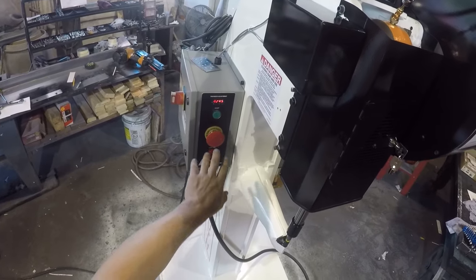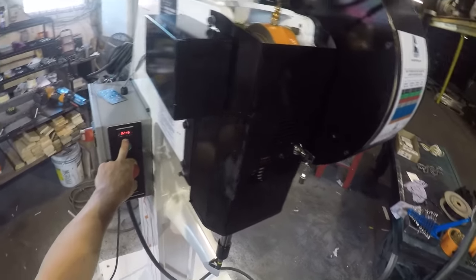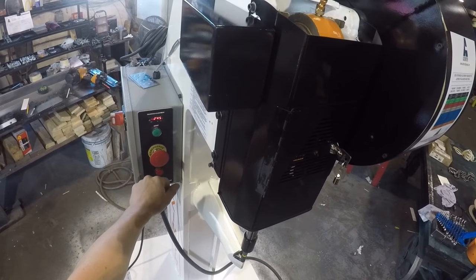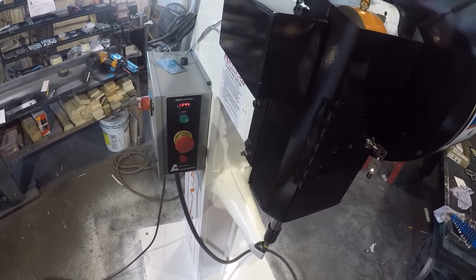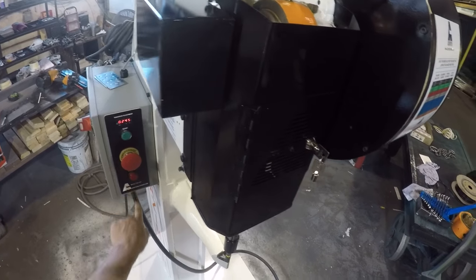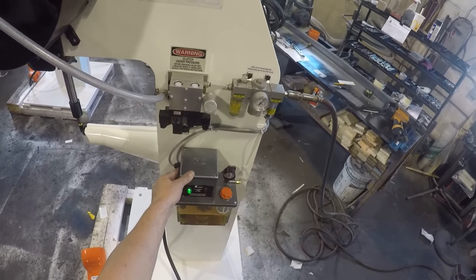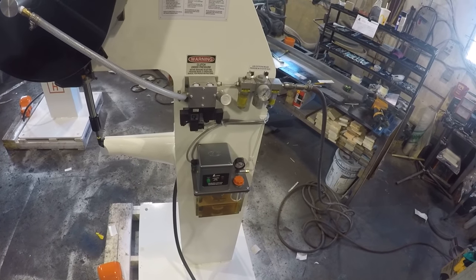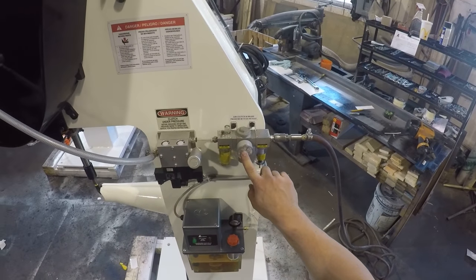This is the view of the control panel. You have a readout for the adjustment of the machine, a start button to start the motor, and an emergency stop that will stop the press within the cycle. There is also a low lube alarm for the lubrication system, which you can manually use, or there is a counter inside the controller that shoots oil every 1500 counts.